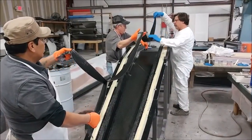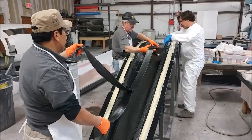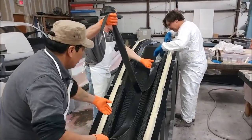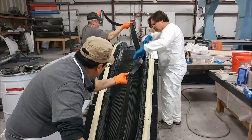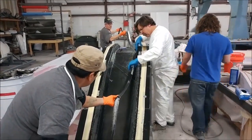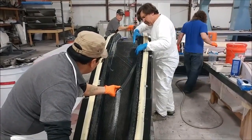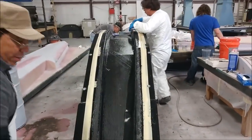Roberto and Chris were back in this afternoon helping Jeff lay the strips that make up the upper and lower spar caps. It's basically a three-inch wide strip — they pre-wet those with resin and then Jeff carefully lays them out along the surface. With the curvature you've got to be fairly careful not to skew it, so it takes a little while to lay each one down.